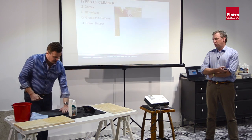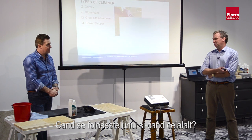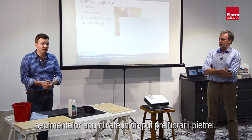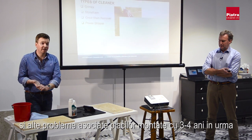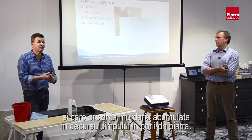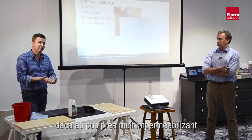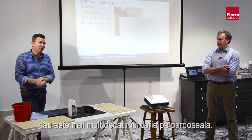What is the difference between Power Stripper and Grimex? Grimex is very good at removing ground-in dirt, grime, and sediment — dirt that accumulates during the manufacturing of stone — and it's also very good for refurbishing surfaces where dirt has accumulated in the pores over three or four years. Power Stripper is primarily used if you've been a little too generous with the sealer and the floor looks patchy, or in extreme cases where there is a lot more than just dirt on your floor.